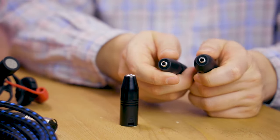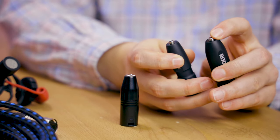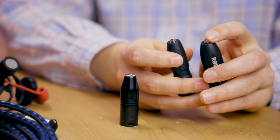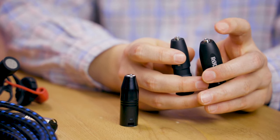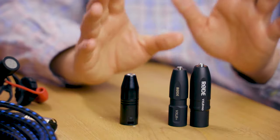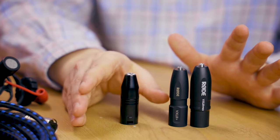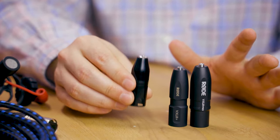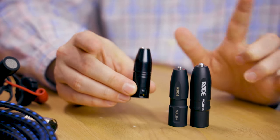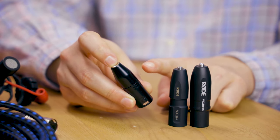You can also notice that the Plus and Pro have a threaded connector on top, so you can actually thread a microphone directly on here — lavalier microphones often use that, and I think the Rode Filmmaker Kit wireless set also uses this threaded connector. So for this first comparison: the Rode VXLR does not transform phantom power to plug-in power; you should only use this adapter when you know your microphone does not need plug-in power and you're also running a relatively short cable.